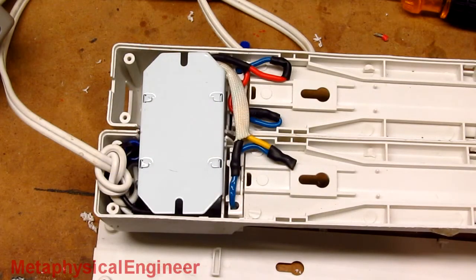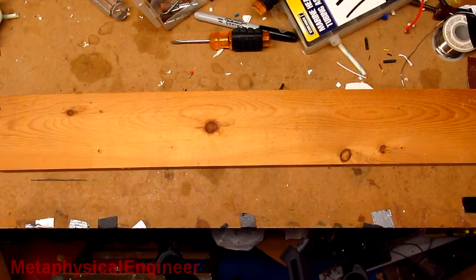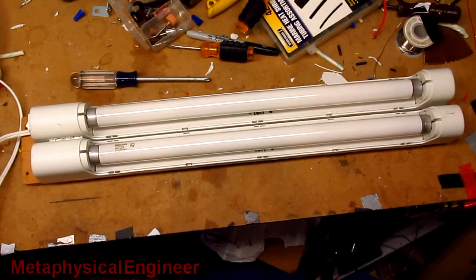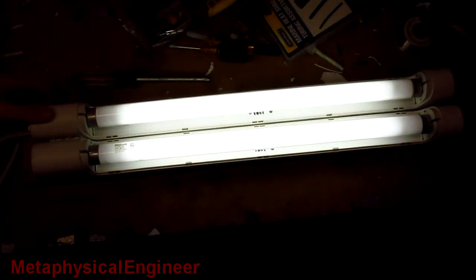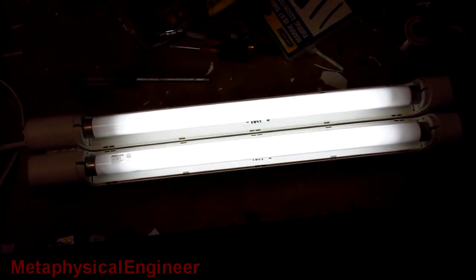Got the slots cut a little bit bigger, almost ready to button this up. After some digging in the scrap pile, I found the original board I used to hold the fluorescent hack together — I was smart enough to label it when I first disassembled. Got it all put together, fires right up. The ballast does say rapid start, but so far it seems to behave more like an instant start. Brighter than before, hopefully more reliable than before, and I've got a mini shoplight again.